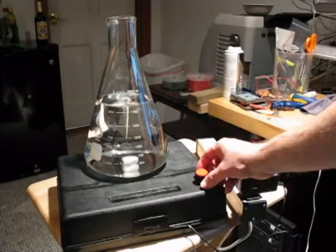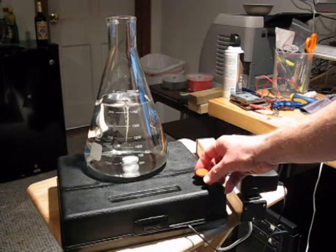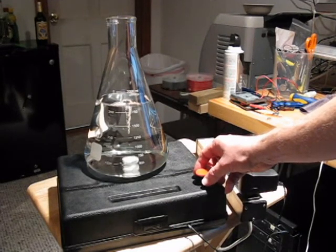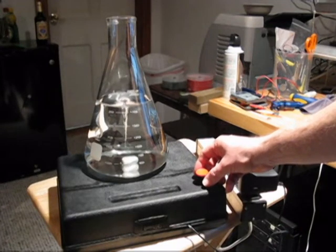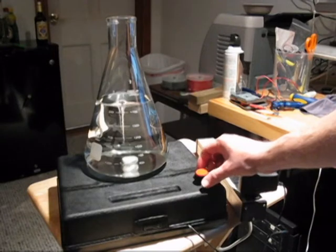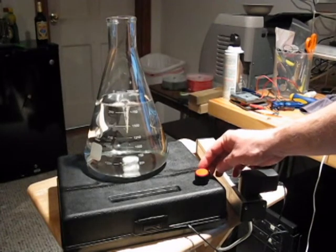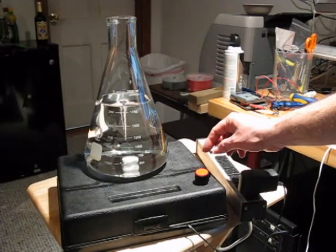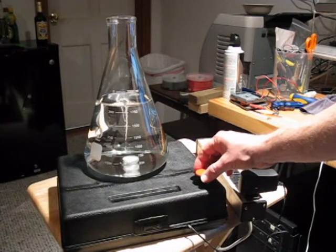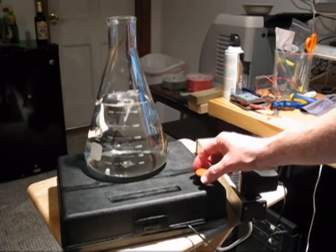With the 25-ohm, I don't have much resolution on the potentiometer. If I turn it up even a little bit, it'll get going too fast. As the vortex goes down and air bubbles hit the stir stick, when too many start hitting it, it causes the stir stick to move. If the stir stick moves too much, it flies off the magnet. Here I'm turning it up from 6 o'clock to 3 o'clock — you can see the vortex is hitting it more often. There it goes, knocked it off.